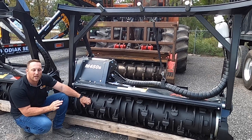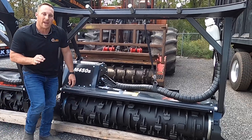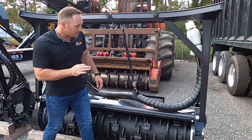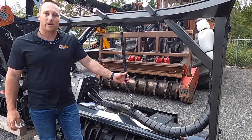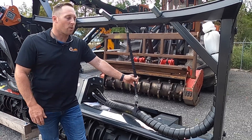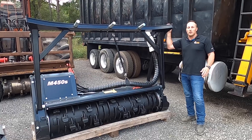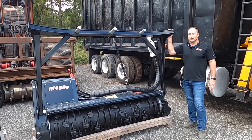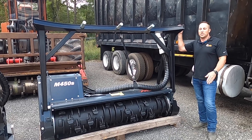That's a six foot cutting area. Overall, it's a seven foot wide head that's five and a half foot tall. These heads also come equipped with hoses from the factory and a factory installed spring. This spring can be lengthened or shortened based on your model. At just under 2,700 pounds, the center of gravity on this head makes it one of the lightest weight heads on your machine.